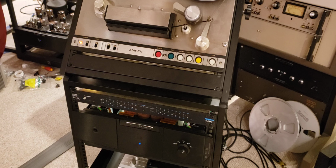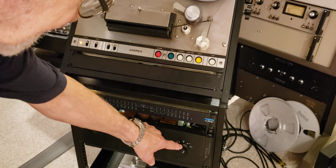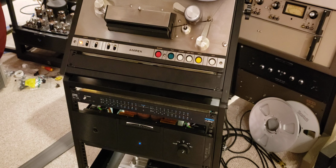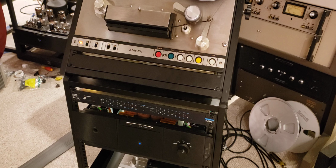It's not very easy. But this particular machine, Ampex 440, 445, had an option of the servo capstan drive. And that capstan drive would allow you to electronically switch the speeds. Yes, it still gives you only a choice of two speeds, but I think there is a trick that allows you to basically slave it to this switch. So the speed selection would be happening automatically as you selected the EQ selection on your preamplifier. That would be a very, very welcome change.